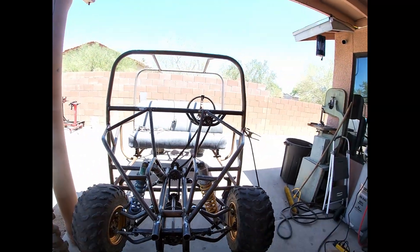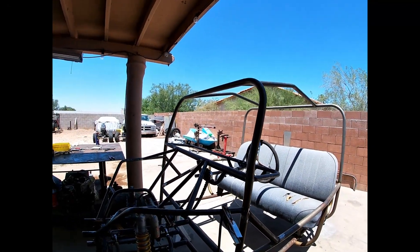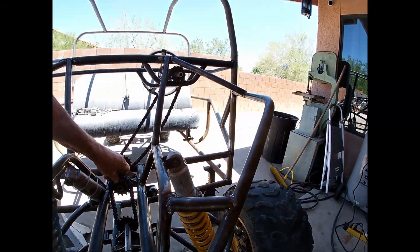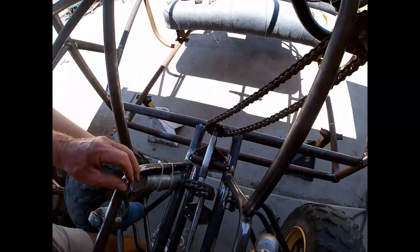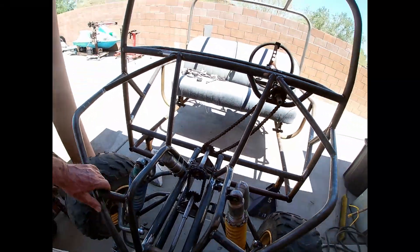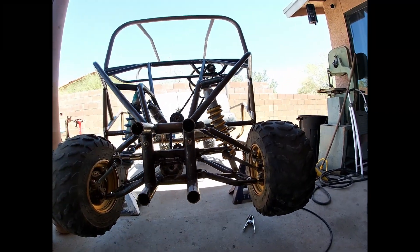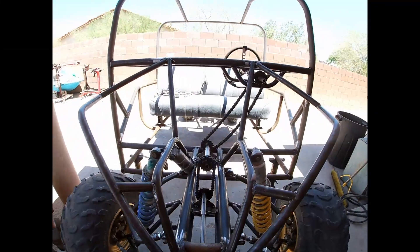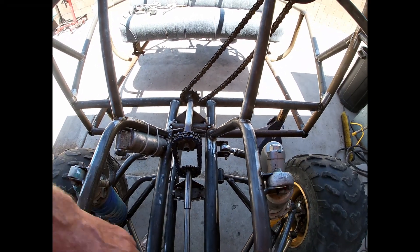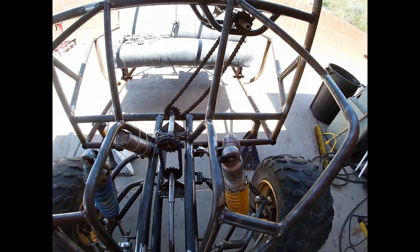As you can see, I've pretty much got things put together. I still need to weld these counter shafts on because they're just doing this — I wanted to get that alignment just perfect. I also made the rack. You see there's two bolts securing it there, and I made this mount here. Two bolts will go down there. For today I'm just going to use a couple of the self-tapping screws to shoot them in there after I get these sprockets welded up.